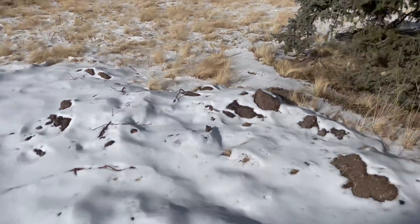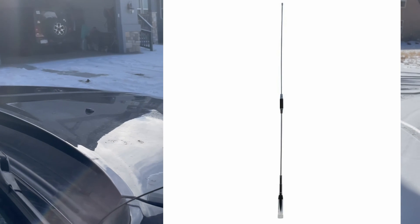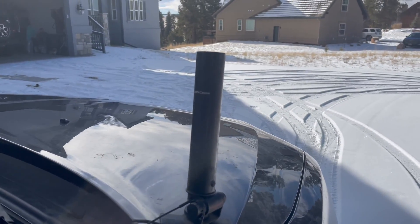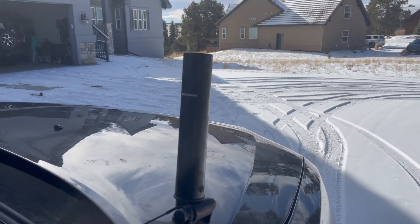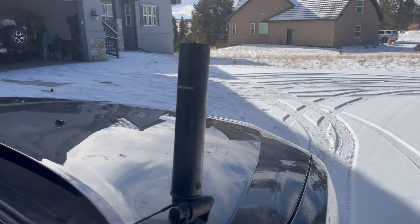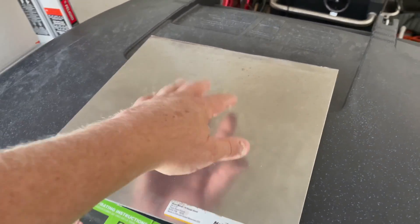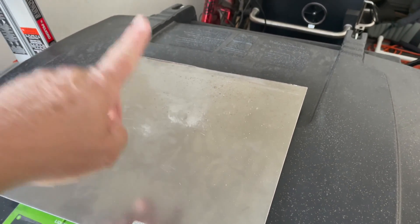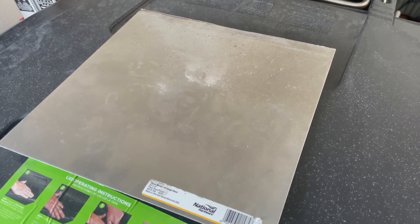For the antenna, it came with a tri-band that was about a little over three feet in height. I went with a compact antenna for the tri-band. For five watts getting out on the 1.25 meter, it seemed to work decent enough for several miles. I had taken the antenna from AnyTone or BridgeCom and magnet-mounted it to a piece of sheet metal — a tri-band magnet mount with an NMO connection, about a little over three feet tall. I would use that on portable activations.